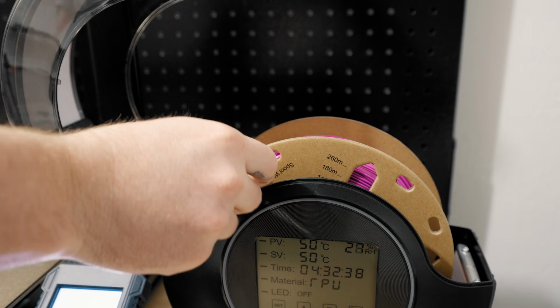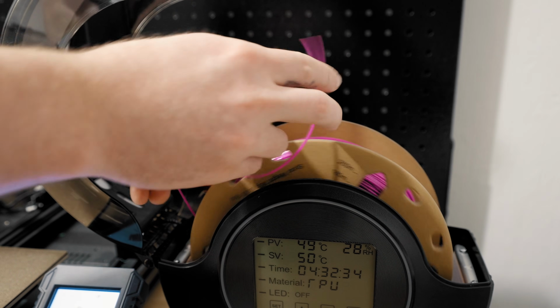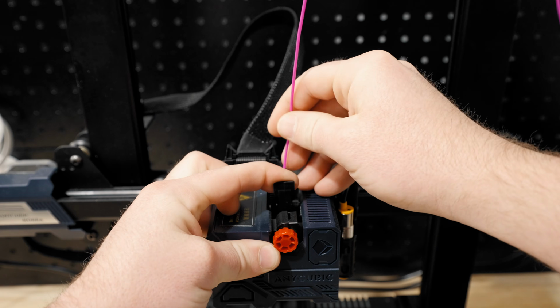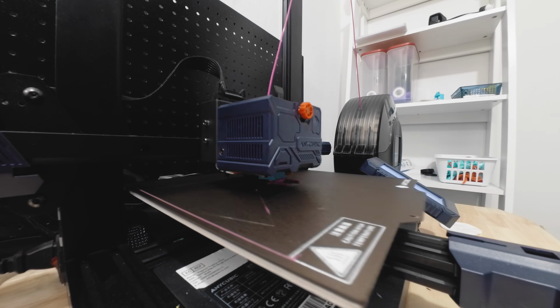When I printed out the drone parts, I printed them with this plastic called TPU. This plastic is softer and flexible, and it should be better at absorbing the vibrations of the drone. And with it removing the vibrations, it should remove the jello from my footage. Each part took only about 20 to 30 minutes to print.